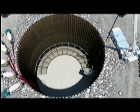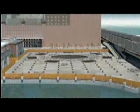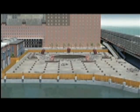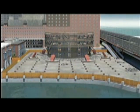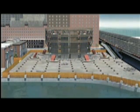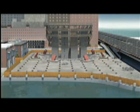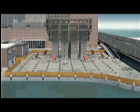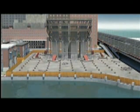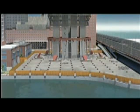It's very common in construction today to use something called a jump form. The jump form comes from the term that you pour a whole floor of concrete, and then it climbs — or jumps — up to the next floor, and you erect the reinforcement and pour another floor, and so on. By the time we get it up through the ground, we hope to have the foundations and the beginnings of the seven columns. And then as the core rises up above the fifth floor, the steel framing can commence.